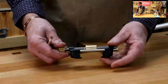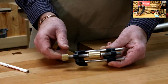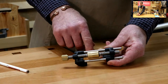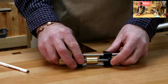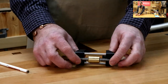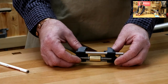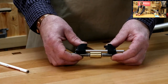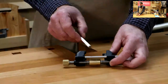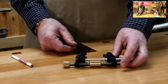So they've changed a few things. We have an adjustable bolt. If I wind it here, it's easy to move. We have our roller in the middle, which moves. That's quite nice. That's brass. The main body, which is black here, is a die cast alloy, but it's got a lot of weight to it. Yesterday I wanted to go upstairs and ask Mark, who's one of our engineers, is it aluminium or something else? Because it's quite a heavy object. The metal bars, the silver here, are stainless steel, so it won't corrode. Fantastic to use with a water stone.